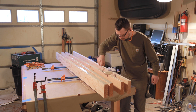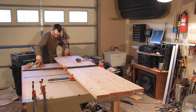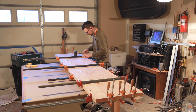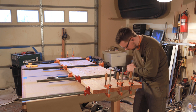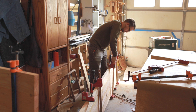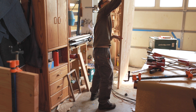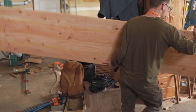Here's the second panel. I found my roller to roll the glue on — it's a lot easier than using your fingers and a lot less messy. Here I am getting those bumps worked out. I like to spend a little time during glue-up trying to get as flat as possible in the clamps. That way when you're done, you don't have to do as much planing and you don't waste as much wood — and ultimately, time.